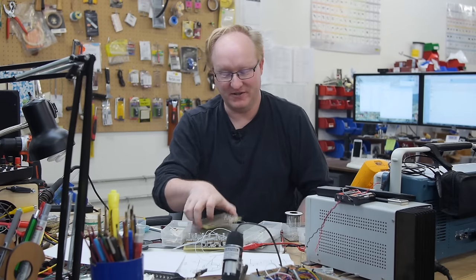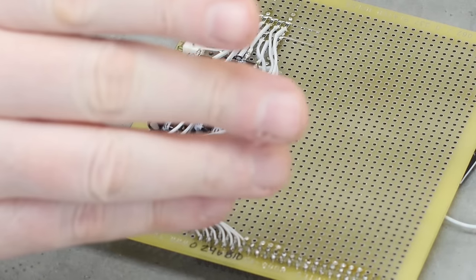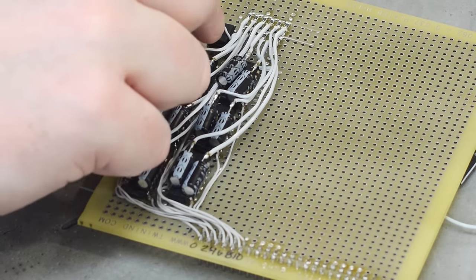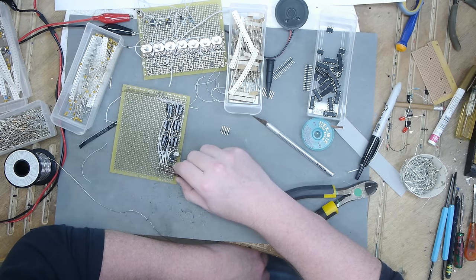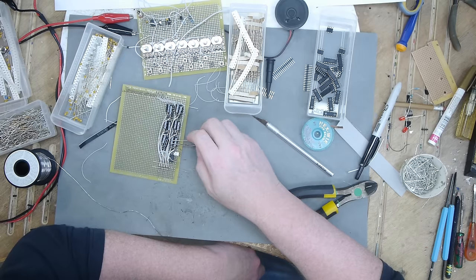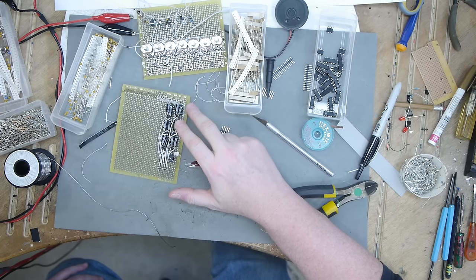It's a lot of wiring and work to do. So Felix and I are going to do just the first 12, and he's also working on the PNP transistor portion of this. If this works, then we'll continue it and wire up the whole keyboard this way. But if it doesn't work, we can change course. And there's a connector here — this is the adjustment potentiometer, and that will be on the keyboard. There'll be four of them, one per octave. You can adjust that to say, okay, that's the kind of sound effect that these 12 notes are going to make. So I'm mixing the audio by having these 470 ohm resistors — we go from the timer through the resistor and then into the bus. Then I'll use more resistors to tie each of the four buses to each other, so there'll be two levels of mixing.